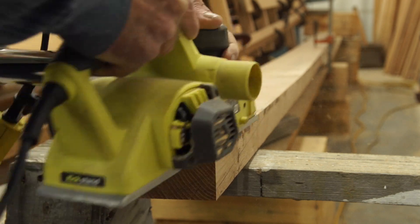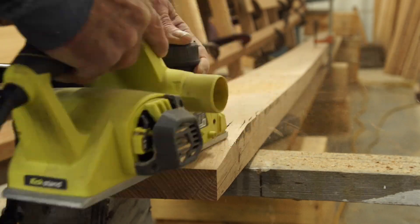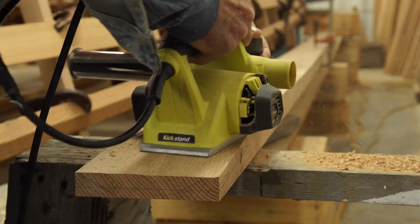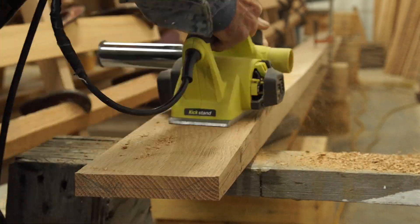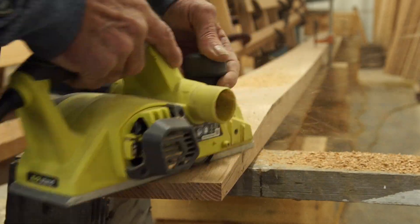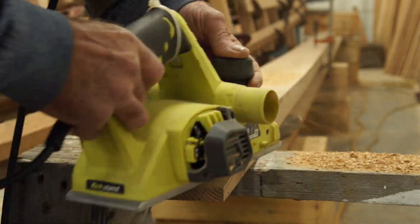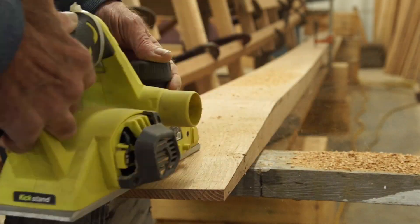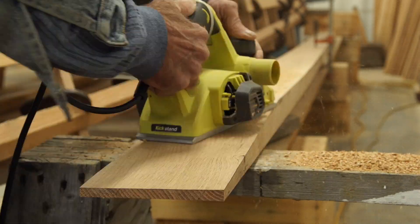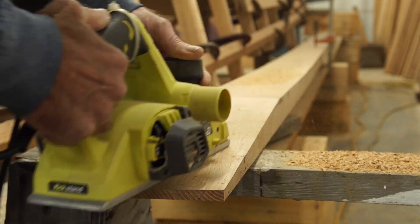The idea is to have a line all the way around it so that when I start planing I'll know exactly where I'm headed. The electric plane is the way to go here again - I don't have to transport this thing over or use any big giant equipment to make a scarf like this. I just pick up the plane right there at the boat and knock it down. I can approach the line and, the way the joinery is done, it's very forgiving - I can tune it up later, slide the keelson forwards or backwards, do anything I want as I put it together. Basically I'm cutting the rudimentary angle down pat before I fit it up in place and take a look at it.